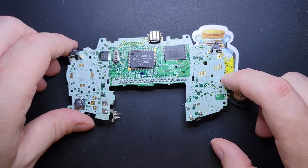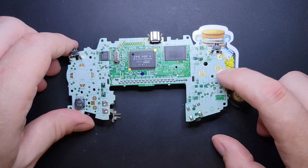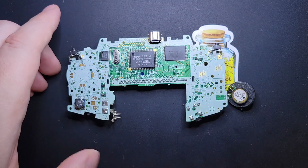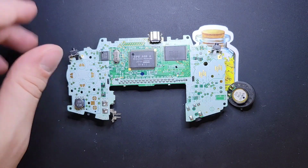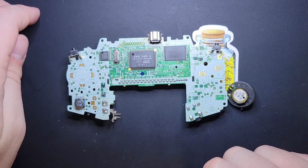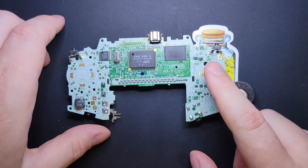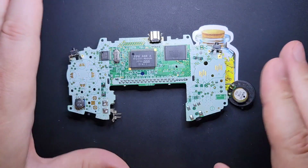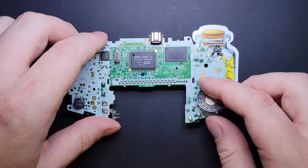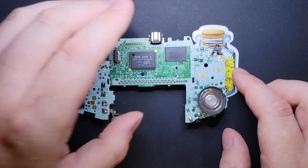If your contacts look messed up, you can try buffing them. You could try a fiberglass pen. You could try like a little Scotch pad. You could try Brasso, very, very small amount of Brasso, but polish these contacts. Be super careful with Brasso. Don't use Brasso, like last resort. Okay. So with that out of the way, let's go ahead and get into it.